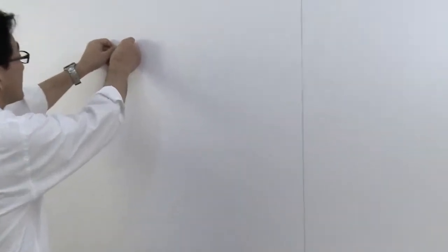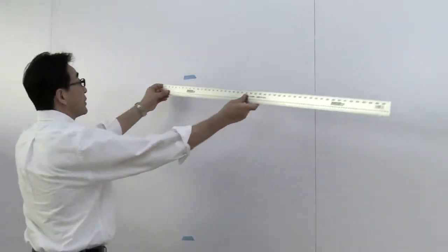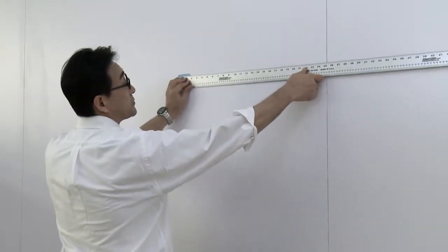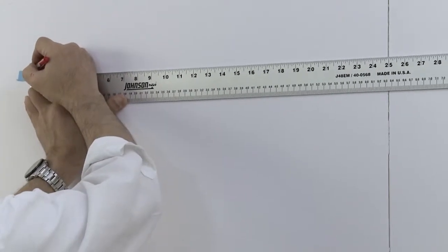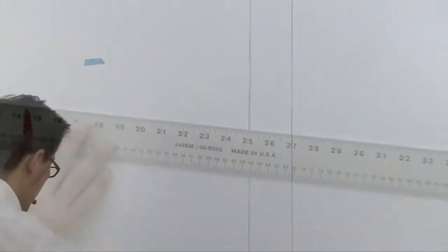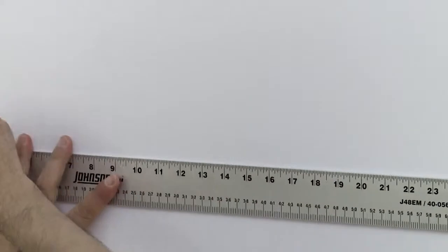Notice the alignment mark on the right side of the wall. Place a piece of painter's tape at the top and bottom of where the double cut seam will occur. Measure for the width of the film panel you are using. Ours is 25 inches. Make an alignment mark on both pieces of tape.